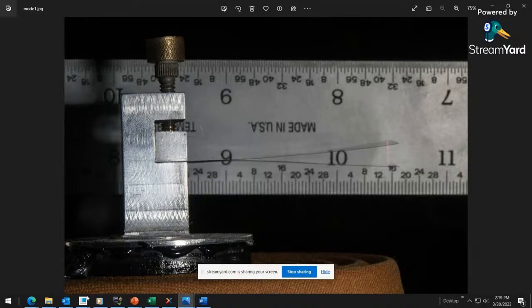We use that data and compare it to the same evaluation of titanium — cutting a titanium reed of the same dimensional parameters as the TechStream reed, placing it in the same clamp, and finding the frequency at which its first bending mode excitation occurs. For each of those reed tests, we excited those reeds with their natural frequency, hit them with that excitation, then removed the stimulus and measured how long it takes that excitation to decay — how long it takes that reed to stop ringing once the signal is removed. So we're basically talking about a waterfall graph.